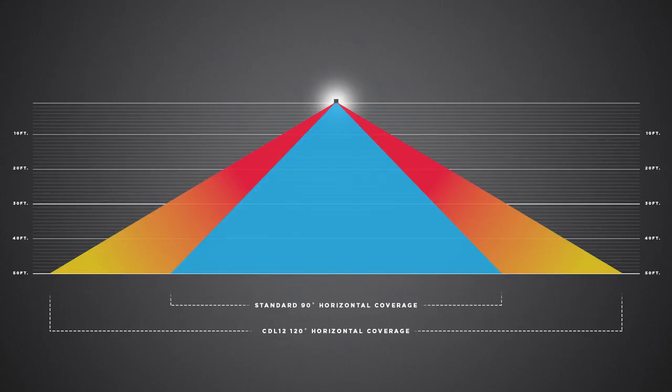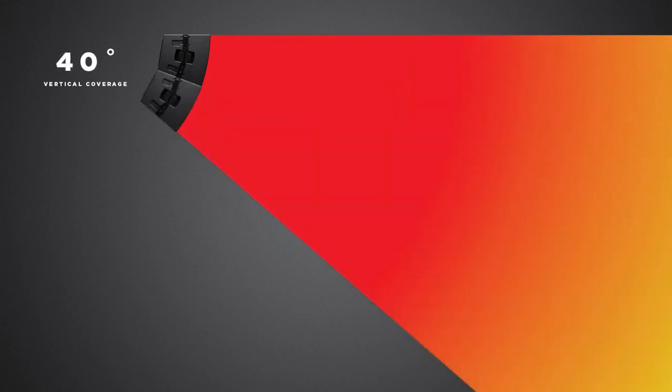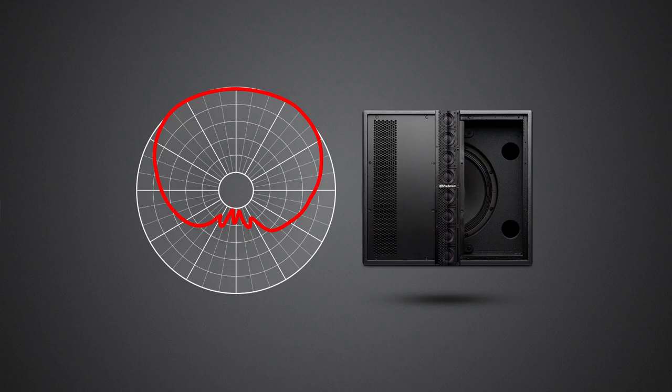With this system, we have 120 degrees in the horizontal and 20 degrees in the vertical. If you're a small church or a small band, you could use one box. If you needed a little bit more level or coverage, you could add two boxes and now you have 40 degrees. You can go with this system all the way up to six boxes — so if you were flying in a big room hitting a balcony all the way to the front edge of a stage, this is scalable. The energy comes right out of the center of the box, so the intelligibility and gain before feedback have a lot of benefits, and it's extremely scalable and cost-effective.